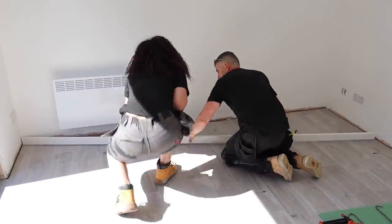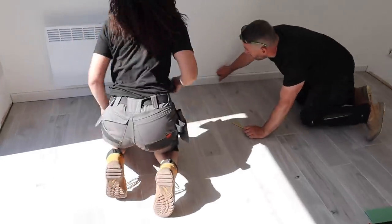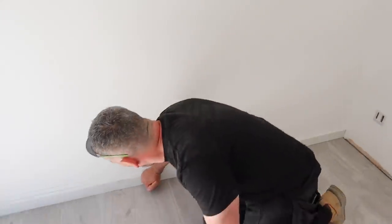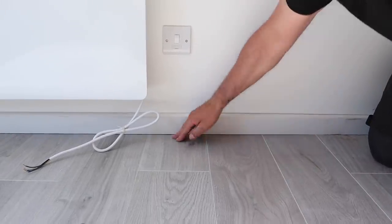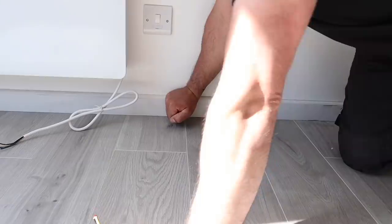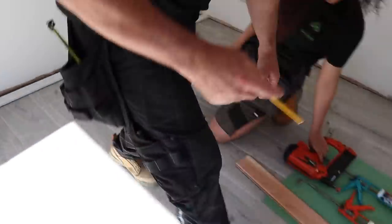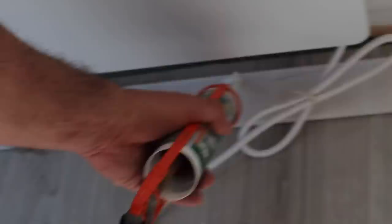Because this room is a rhombus, it fits, it's white, we're going to caulk it, it's going to get painted up, if it's a little bit small, it's not the end of the world, but it does fit. But when you glue it and pin it, you need to push it down, because of the laminate floor, can you see the flex in the laminate floor? So if you push it down like that when you pin it and glue it, we're going to pin it every 400. We are going to glue it with instant nails. It's a water-based adhesive. It's going to shoot down there like that.